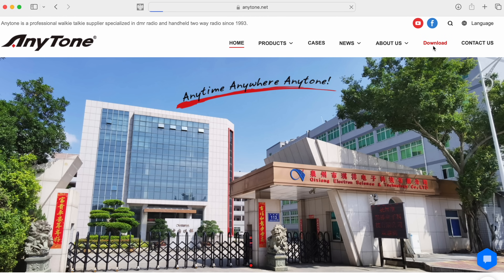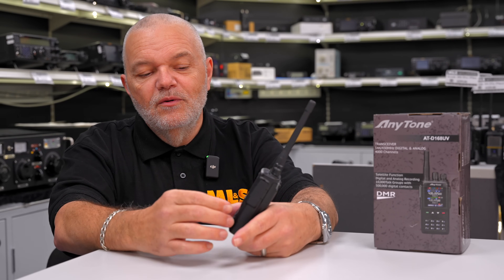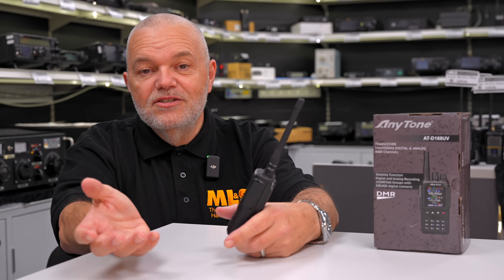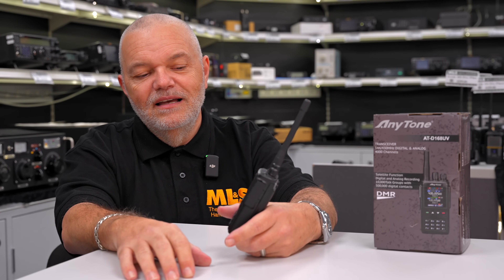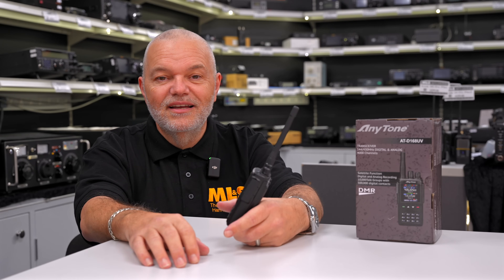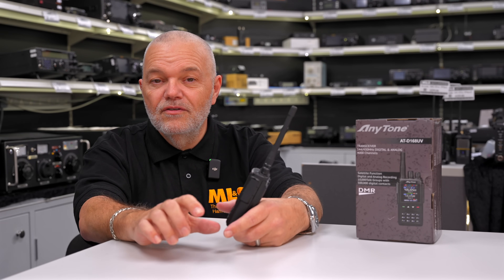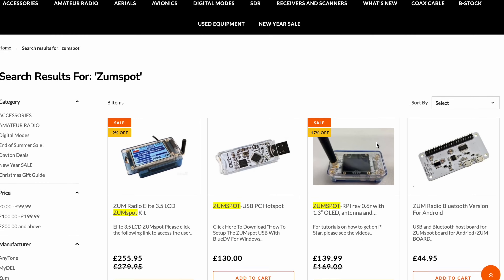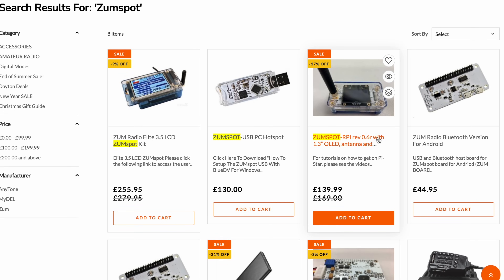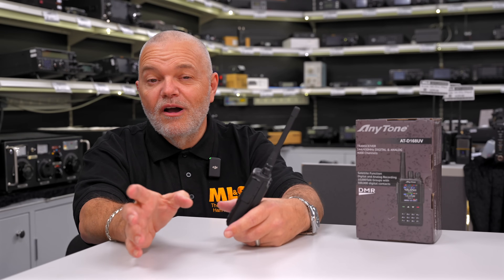You can get the software from the Anytone website and you can also download basic code plugs that will allow you to put all of the IDs in. So if you haven't been on DMR, you'll have your own ID and you'll be able to program all of those up into your radio. When somebody is talking in a room, just like your phone when somebody rings you and you've got their number programmed in, it'll come up with their name — that's pretty much what we're doing with the code plug in simple terms. Once you've done that, you can then over RF call into a DMR room via a repeater — over RF in your local repeater. But that's not the end of the world if you don't live near a DMR repeater. You can get ZumSpots — a little device that connects to your internet that your radio will be able to communicate with over RF on low power, and you'll be able to access these rooms and conversations via the internet, but you'll still go out on RF in some places.